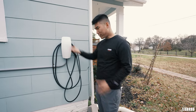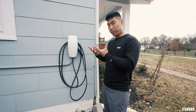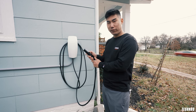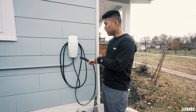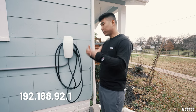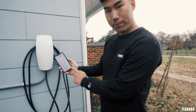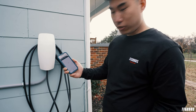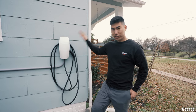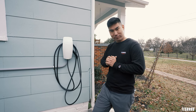A few extra tips: within the first five minutes after you turn on the breaker, the charger's Wi-Fi network will appear — that's when you need to connect. If you run out of time, hold the button for about 10–15 seconds to reset it and bring the Wi-Fi back up. Then go to IP address 192.168.92.1 to set up firmware updates and settings. One really cool thing compared to the older model is that I can now check my data and software updates right from the app — just like your car. Overall this was a really easy install. If you have any questions, let us know in the comments below. Stay charged!